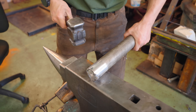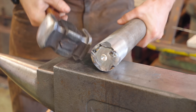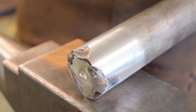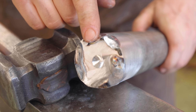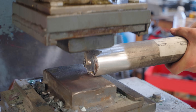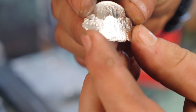How about when it's cold? That was loud! Interesting though — a crack is starting to form around where it had some little TIG weld puddling. We've got a break. So its malleability when cold isn't super good, because though it's fairly soft, it does like to break. Cold under a 25-ton hydraulic press — that's terrifying! It's just so interesting to look at how that breaks. I've never seen anything break like that. The thing it broke off is so shiny.